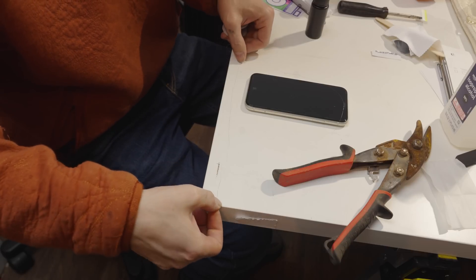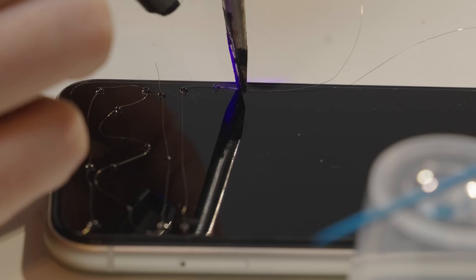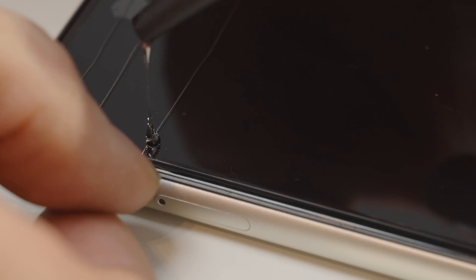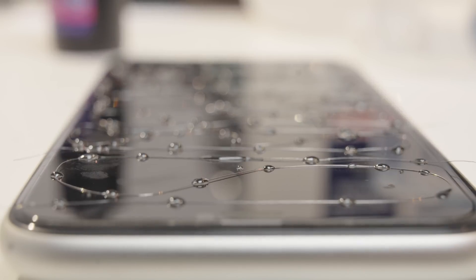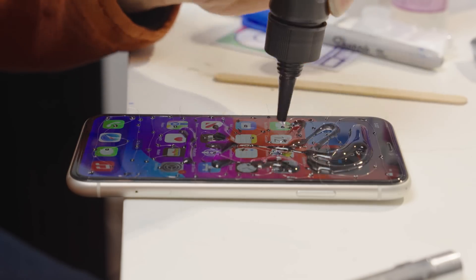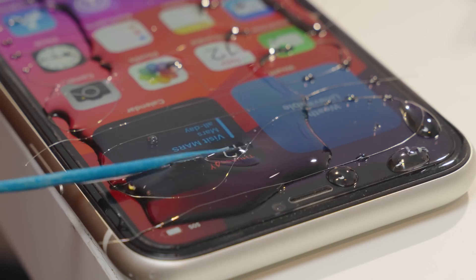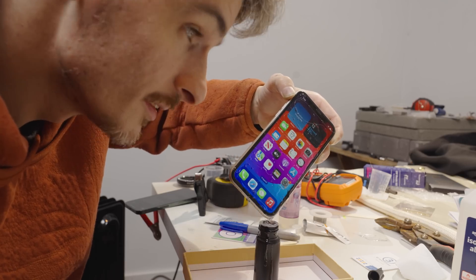Time to move on to the big boy version. The heater for the screen consists of five very thin and precisely cut wires. I have to attach these each one by one to the screen with epoxy. It's not the placement of the wires that matters — it's the thickness of the epoxy that's the problem. After applying the epoxy, I tried heating it up to make it thinner, trying not to spill it off the edge. I messed up — good thing this is super easy to clean.